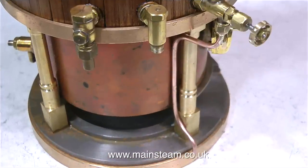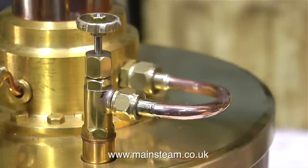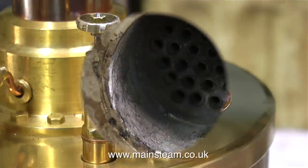While this white paint was drying, I fitted a small piece of pipe to the water gauge blowdown valve. While I was making this pipe, I kept seeing the string-coated pipe on the bench — and the more I saw of it, the less I liked it. Once the paint had dried, I removed the string from the pipe and polished it up on the polishing spindle, and it looks much better. It doesn't need any thermal insulation at this point, because the wet steam comes from the tap and goes straight into the superheater.